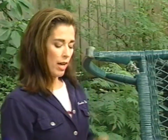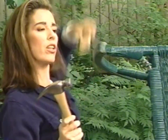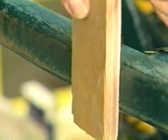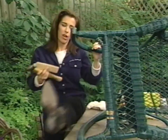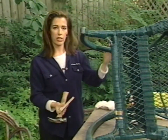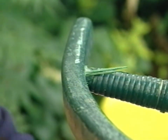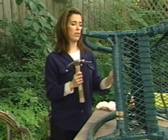I'm going to take a block of wood and hammer the runner onto the leg here. If you find this is a bit awkward and you're worried that your glue is starting to set up, just take another brush and dip it in a little water and go over the glue a bit — that'll retard the curing rate so that you don't end up hammering your rocker onto a completely dry leg.